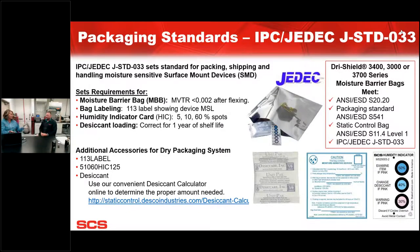Sure. Speaking of JEDEC, which is really a standard that was developed around the surface mount device industry, but applies even more than that, kind of addresses the bags, the whole system, the humidity indicator cards, the desiccants, the labeling. All of those go into a dry packaging system. I think we have some examples of those just to kind of show everyone. Yeah, we did. I think they're over there.